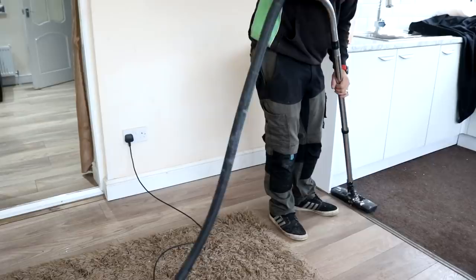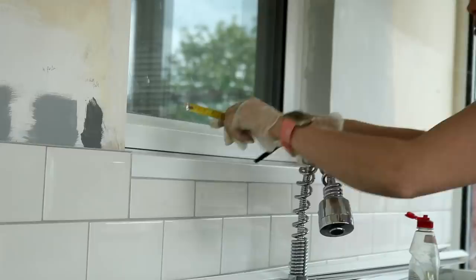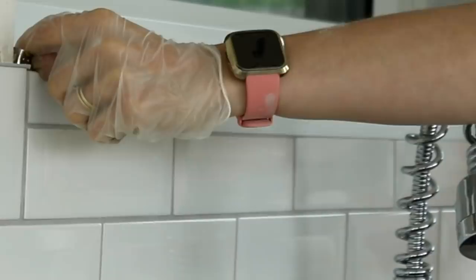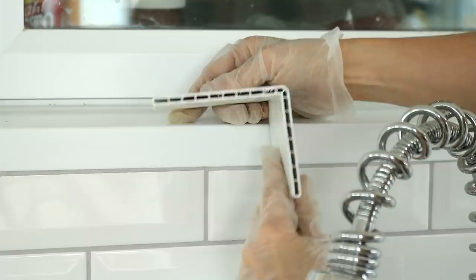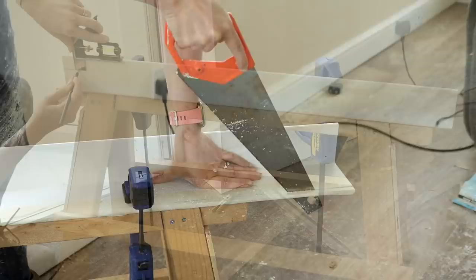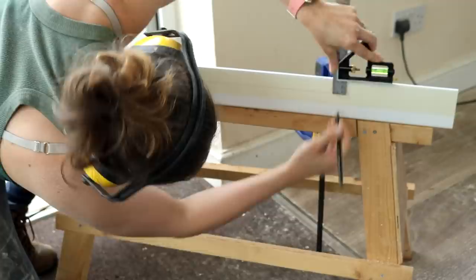On to a new day — something that was bugging me was seeing raw tiles underneath the lip of this windowsill because the windowsill was too shallow. I'm measuring the width of it, and the only thing I found suitable for the job was this 90-degree hollow trim from Uracel. I decided I could cut the same thing just to cover behind the conduit as well. I've measured and clamped it to my saw horse and, using a mitre cutting box, I'm cutting with a fine tooth hand saw, trimming off a little bit at the top back first because it stuck out too much. For the lip, I'm using a speed square and drawing along some masking tape, and because it's hollow, I wanted to go over it with silicone before putting it in place and smoothed it over with a credit card.